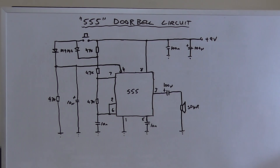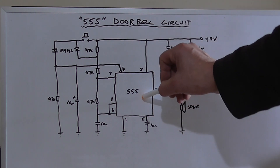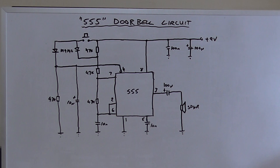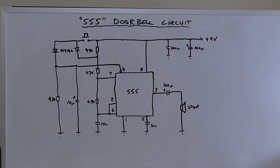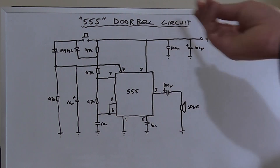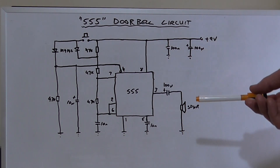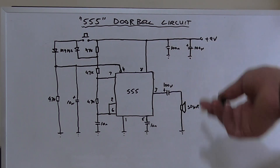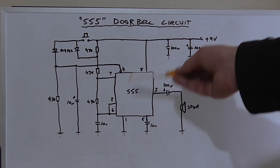The oscillator and VCC will be connected to the battery all the time, so there's going to be some constant current draw through the IC. However, as it's not oscillating it won't be drawing much because it's not driving the load. This circuit would run on a 9-volt battery for a pretty long time. In standby — when the button's not pressed — I reckon that battery would last quite a long time, because I don't think this IC draws much current when it's not doing anything.